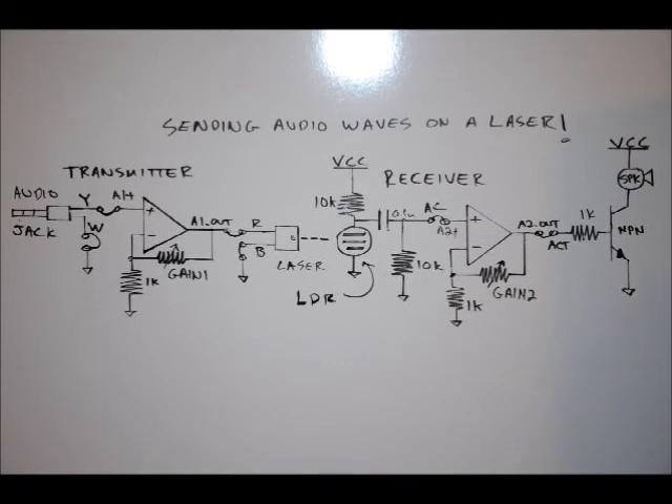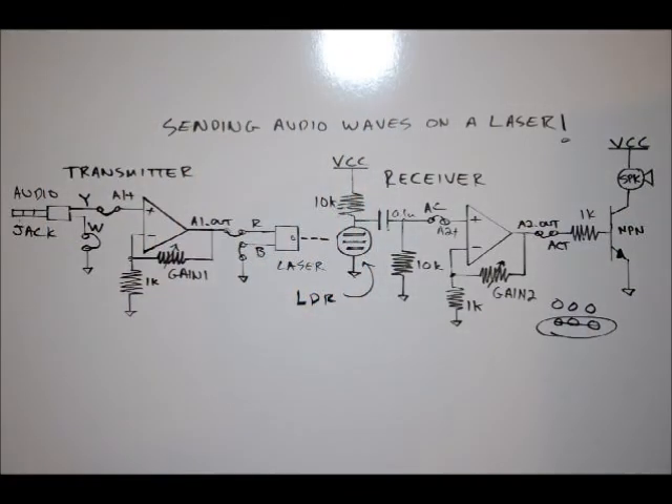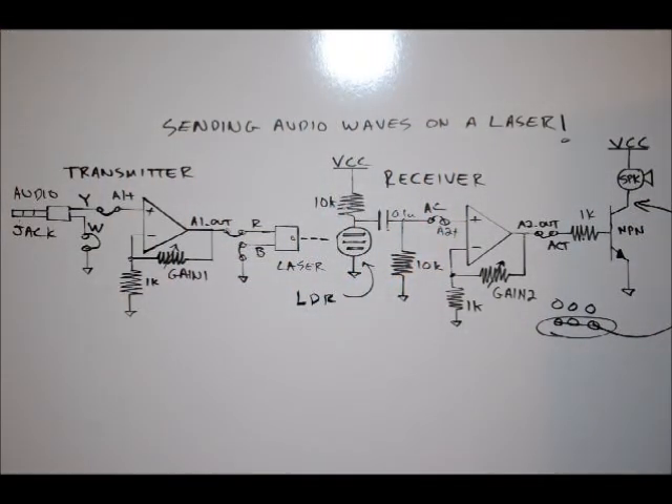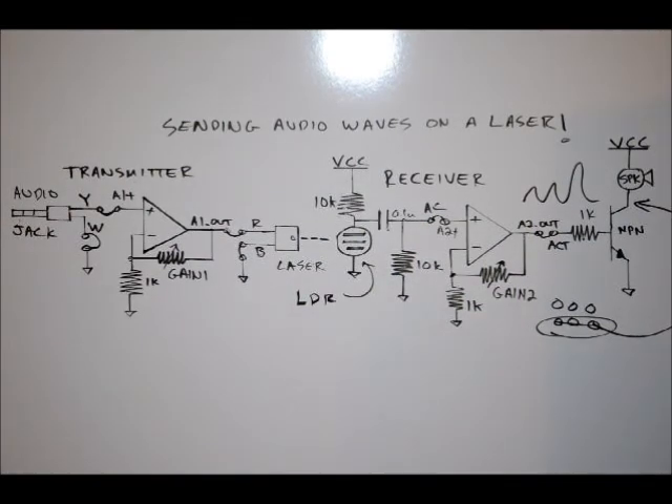We're not going to have any shorts on our actuator pin block — we're not going to be selecting the relay, motor, or buzzer. We'll leave that open and connect to any one of the four bottom pins. Those pins are connected internally, whereas the tops are connected to the motor driver, relay driver, and buzzer driver. So we have one side of our speaker connected to VCC, the second connected to the collector through the actuator pin block, and we should be able to drive that transistor to drive our speaker. Again, there are better ways of doing this — the audio sound quality will not be great.